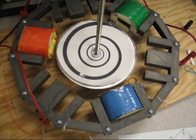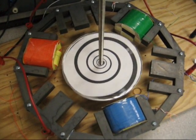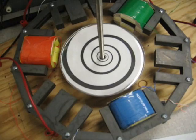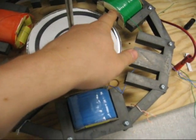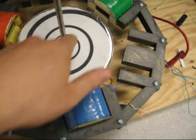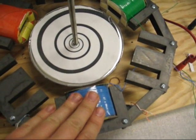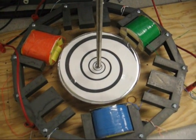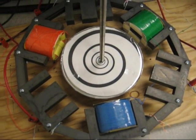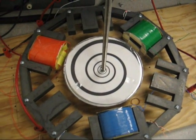Okay, so applying some voltage — let's see what happens. You can see it didn't get going very fast, probably because the flux has to actually travel from this coil through the rotor over to this coil, so that's not a straight path. Most of it wants to go straight across, so you have a limited amount coming into this one. So that sort of proves that it might work, but it's obviously not spinning the rotor as fast as before, so either the design needs to be changed or it's just a bad idea to begin with.